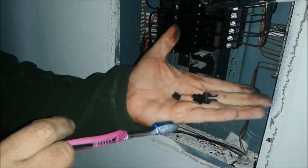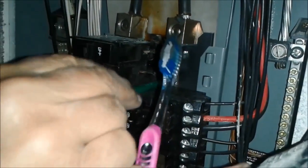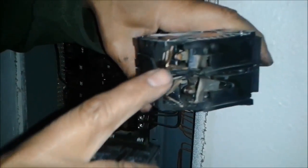This is the part that disintegrated, belonging to the 60-amp switch breaker. If you look carefully, you can see how black it is — it matted everything. I had to clean it with a screwdriver for over 10 minutes, and then with a brush to remove all the debris. Now everything looks ok. Remember there is no electricity here — that is very important. Now when I am ready to replace it, I am going to replace it with a Siemens 60-amp breaker. This breaker is broken — everything is really melted. Let's replace it.